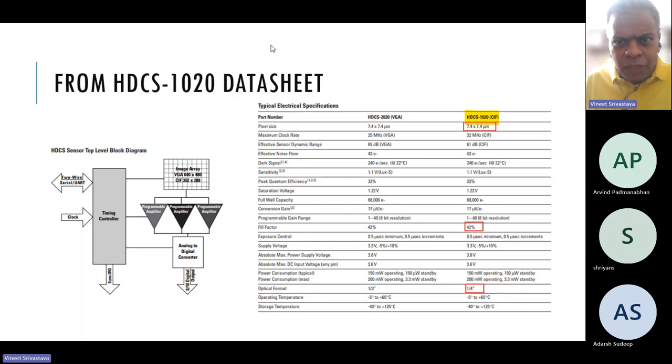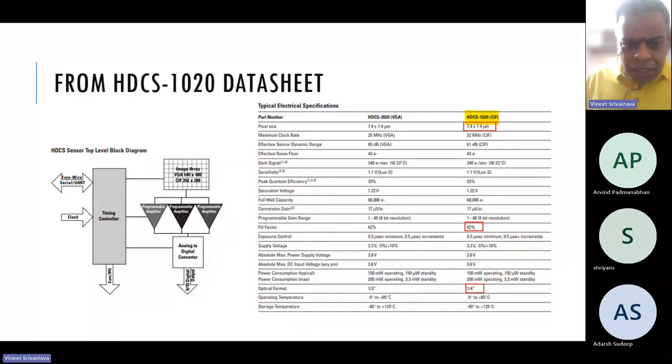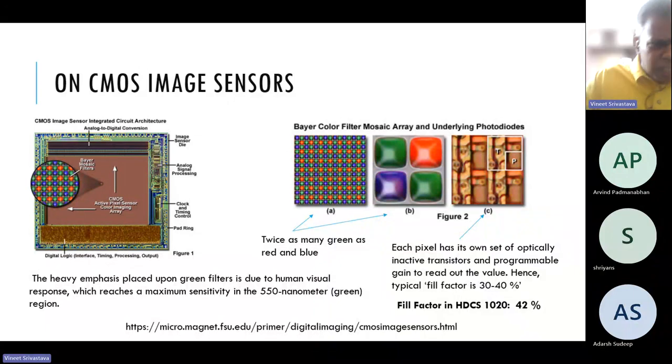I read that the ultimate goal of an image system is to replicate the eye because the eye is so amazing and can do so many things. Apparently we are getting quite close to that with modern cameras. Going back to the data sheet, it turns out that each pixel inside this sensor is 7 by 7 micrometers — about the size of a yeast cell. Today's cameras have pixels which are 0.5 micrometers by 0.5 micrometers. That's why we've gone from these rudimentary resolutions to something like 8 megapixels or even more. The pixel size has become so small — optics hasn't changed, but we've managed to shrink it all down. There's also something called fill factor — the active area is 42%. Each pixel follows what's called the Bayer matrix.